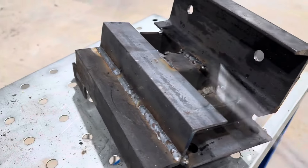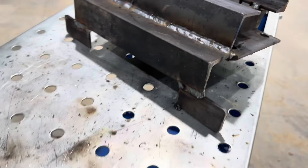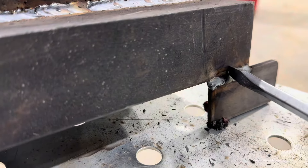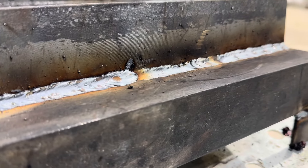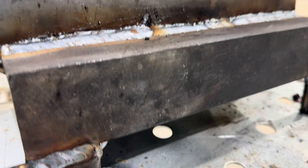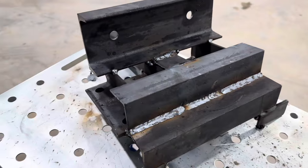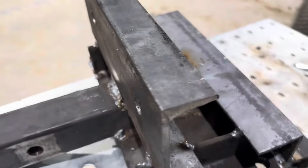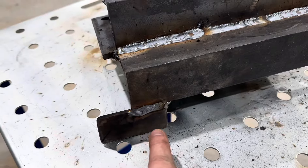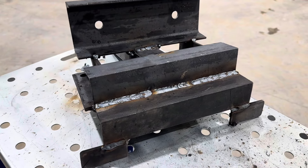Now this has to cool. We've got to clean up this face right here because this is the face the fairlead is going to mount to — the fairlead should have a flat back. We're going to very carefully take a flex wheel and just flatten these out so it's flush. I'll also take a grinder and clean up some of the straggly edges. This is mostly scrap metal so it's not perfect, but it is strong. Hopefully you guys enjoyed that — that's how I tackled this project. Once it's cooled we're going to drill the tabs right there and right there for the fairlead face, then get it coated and move on.